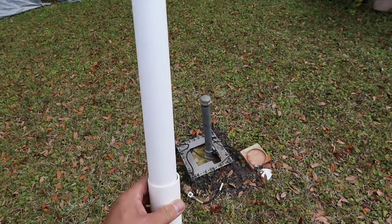This is what we've got — the PVC connected to the pipe, using three to five inch stainless steel hose clamps. I put some plastic tubing around the clamp to prevent chafing. This is stout, this is not going to move. It's double-tubed: inch and a half on the outer and inch and a quarter on the inner. We're going to test the plumbing.